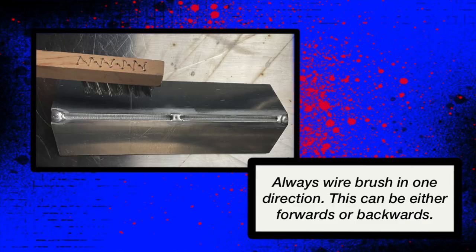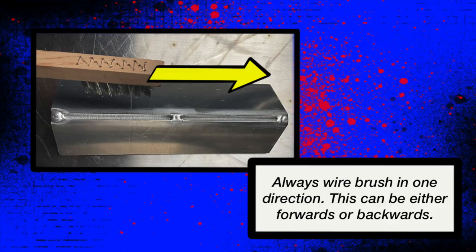Let's address the comment that was actually correct. Ideally, when you wire brush, you want to wire brush in one direction, and you want to do it lengthwise to the weld path. The reason this is so important is that if you have any contamination in the joint that you are wire brushing, brushing both ways can actually impregnate a lot of that contamination into the welding joint. Doing it lengthwise is also going to help eject any contaminant out of the joint, whereas brushing side to side is not going to clear contaminant out. Brush lengthwise and in one direction — that's a great rule of thumb.